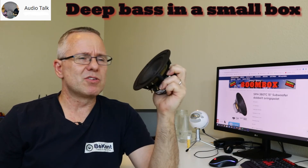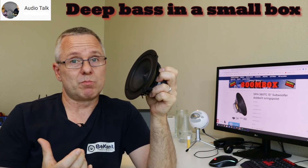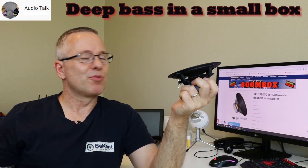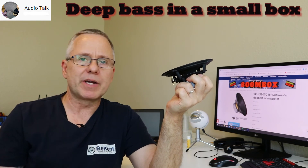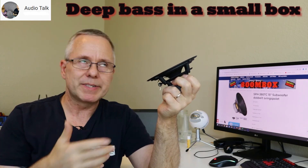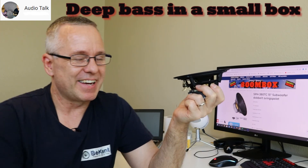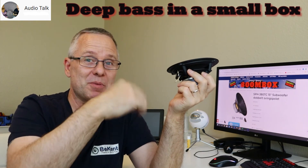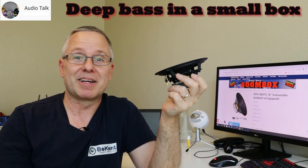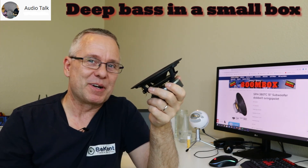I hope you get something out of that — now you know what you're up against. If you want really deep bass, it's going to cost you some energy. Particularly if you want the box to be small, it's costing you even more energy to get down there. That's the cruel reality of physics. I know there's a lot more calculations to it, but please ask questions down below and I'll be happy to answer them. Maybe it will spark a question good enough for another video. Please comment. Thank you for watching — hopefully see you next time. Ken from AudioTalk, take care, guys.